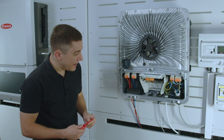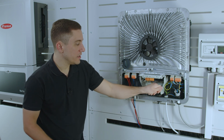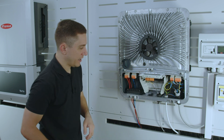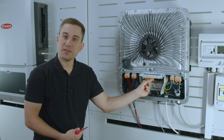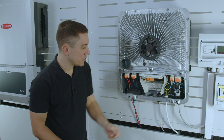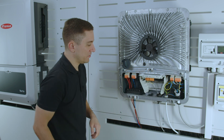To exchange the pilot card, you have two screws on the left and right side of the pilot card, and furthermore a separation unit to exclude the DC from the AC side and from the data communication side. To remove the pilot card, we first remove the plugs for the data communication, second we remove the screws, and last but not least we remove the cover for the separation part with the two plastic covers left and right of the pilot.